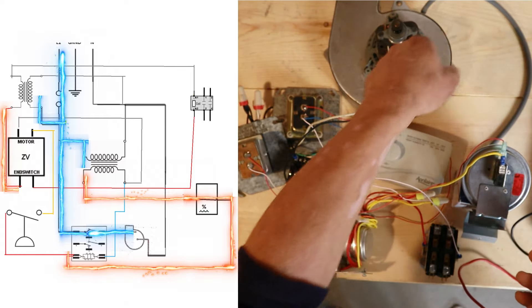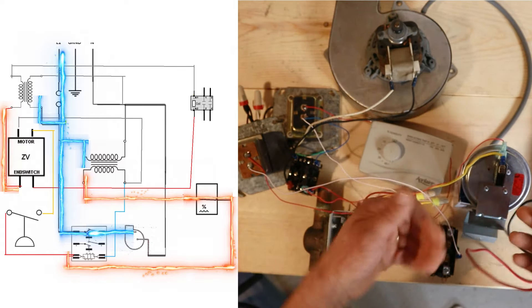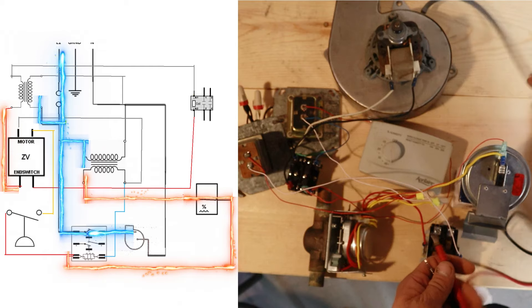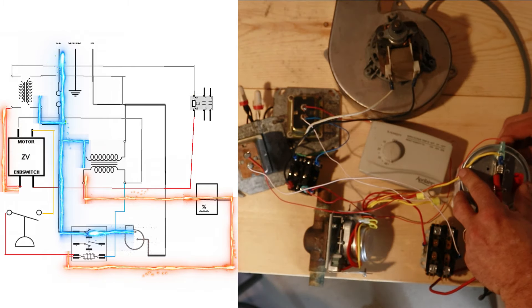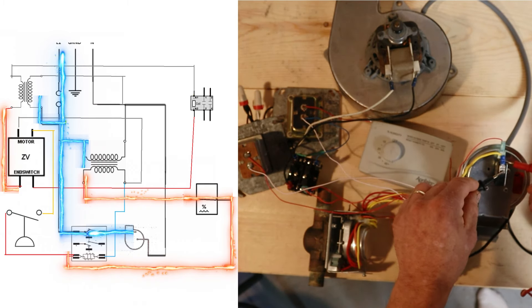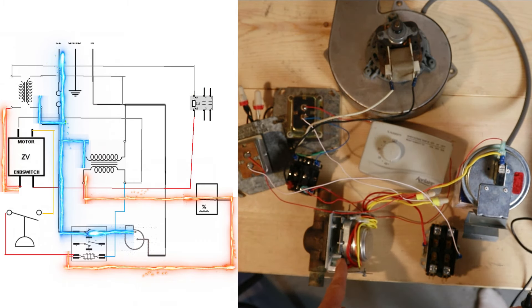So what I know now is that there's something wrong with either the diaphragm in there, or the hose that is supposed to pull it in is clogged or disconnected. Let's go ahead and inspect everything. There's your problem right there - the hose is disconnected. I'll go ahead and push it back in. Now testing voltage across both terminals and I'm reading zero volts - that means my switch is closed, my zone valve motor should be operating, and my contactor is pulled in. Once you have a fundamental understanding of how parts work, how to trace a schematic, how to use a multimeter, and when to determine if switches should be open or closed, you have a lot of the information you need to start weeding out problems even without years of experience.